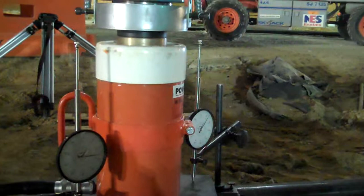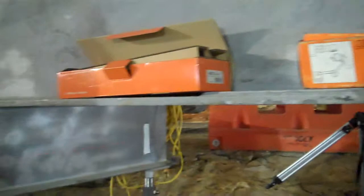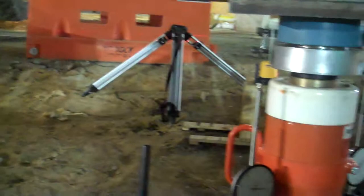We're going to continue to push the limits of the pier, just to make sure it holds up to the standards for this particular job site. We've installed these piles to a torque correlation capacity of an ultimate load higher than the design load — higher than the service load that the pile's actually going to see. And that gives us a factor of safety.